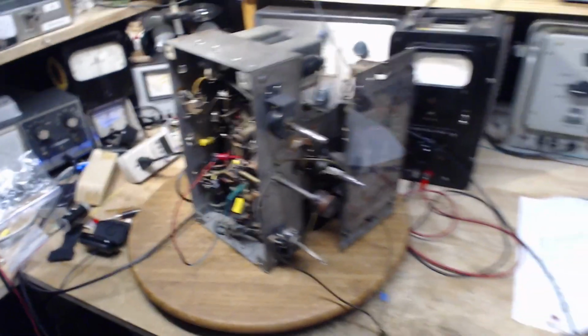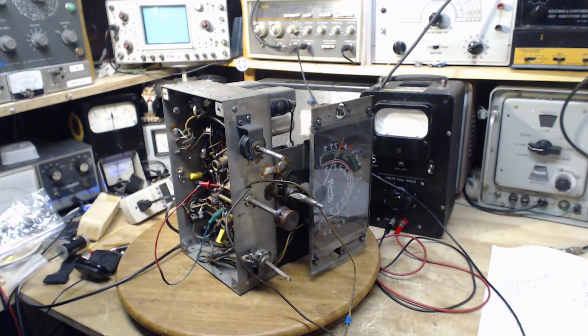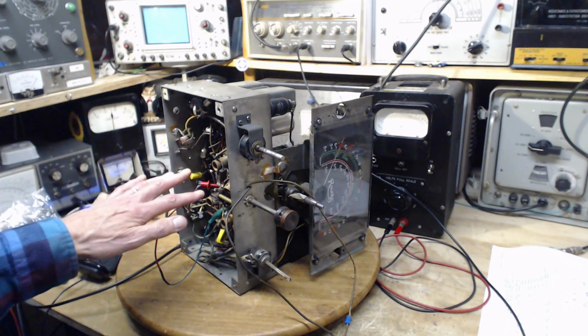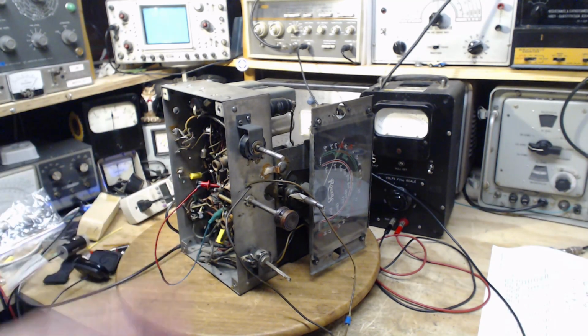Okay, I think I finally got somewhere. I think the solution here is the internal antenna coil is shot. So if you connect an antenna that is essentially the same sort of thing as the antenna coil, you can kind of restore the radio back to its former glory just by bypassing that transformer coil. Maybe not quite its former glory. If this coil were working properly and you used a loop antenna, you would get two bangs for $2 out of that. You would actually work fine.